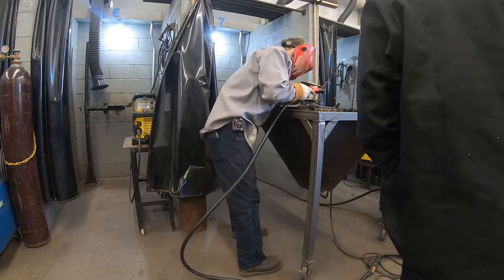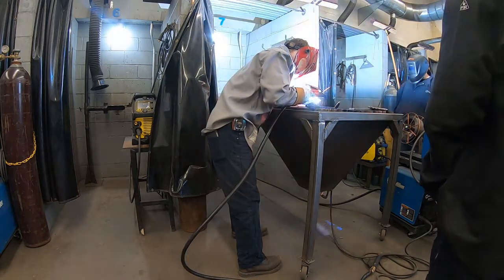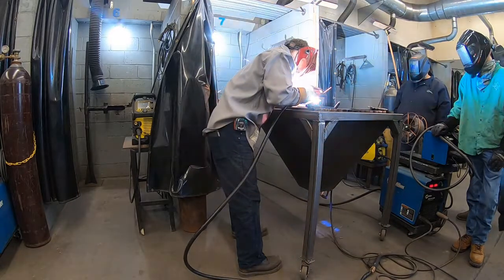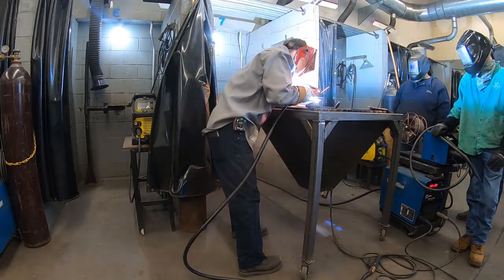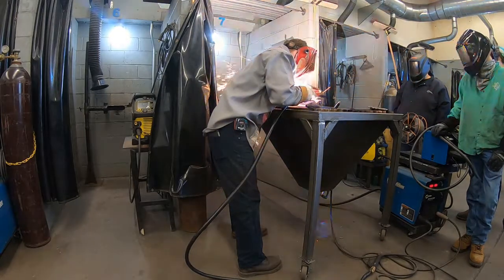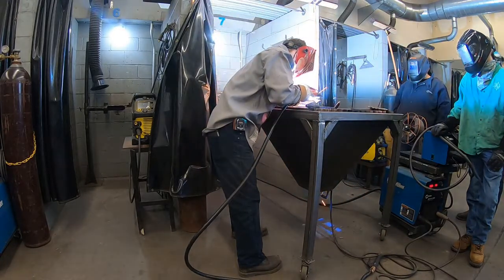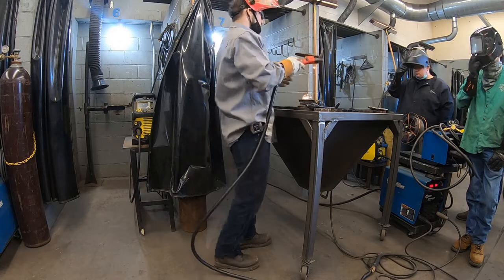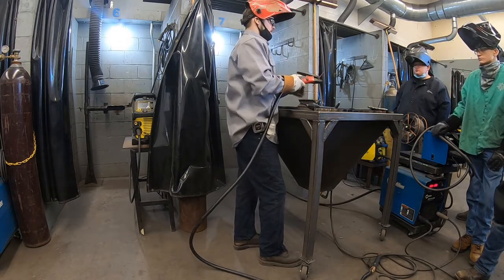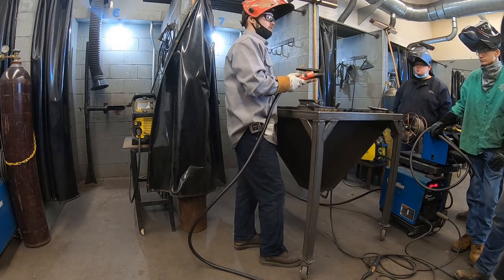Since this is a little bit wider, I'll show you what washing looks like. We're going to do the same thing except just working side to side. I'll let you guys go ahead and practice as well — remember, six inches stick out. One more note: if you try to go too far down with the electrode, it's not going to blow through everything. If you go down too far, it's not going to blow all that material out.